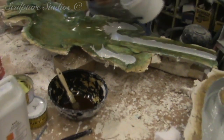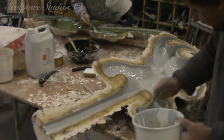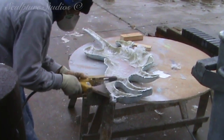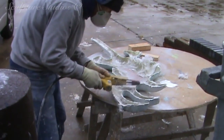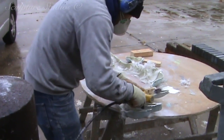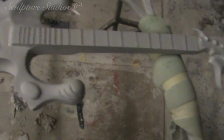I said Coca-Cola earlier — I bet somebody bought that. I should have said Iron Brew, that would have been better. Going in with a few layers of resin gelcoat provides a thick, smooth layer for each half of the cast. This means that any sanding and cleaning up later will be through a thick gelcoat surface, before sanding down too easily to the bare fibreglass underneath.